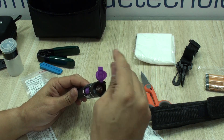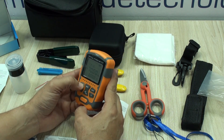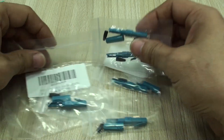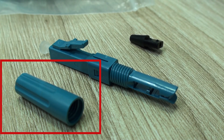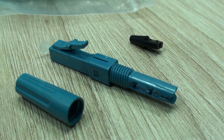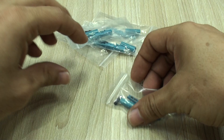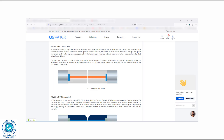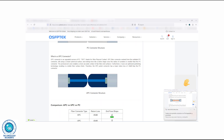The kit includes a little more, actually — a fault locator and an optical power meter, both very useful. Also this package which includes five connectors with four components: the terminal itself, the contact cap, the locking cap or mechanism, and a very small fiber wire guide in case you don't use the cable jacket. These particular LC connectors are UPC, and it might be interesting for you to understand the difference between UPC and APC connectors — I'll leave links in the description for some interesting literature about it.